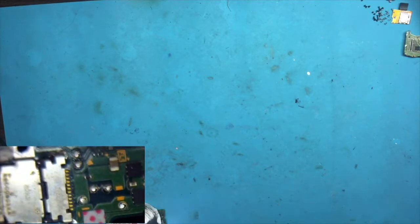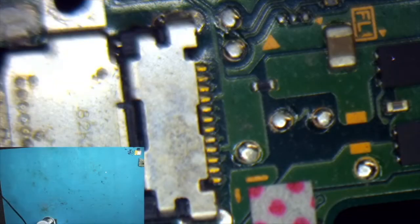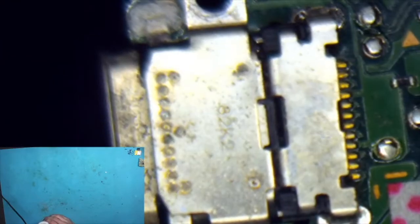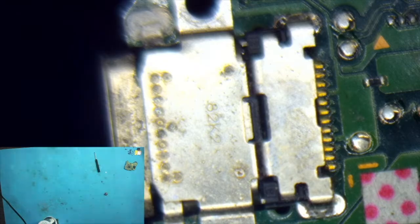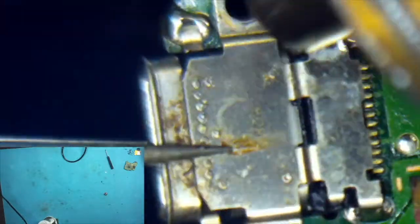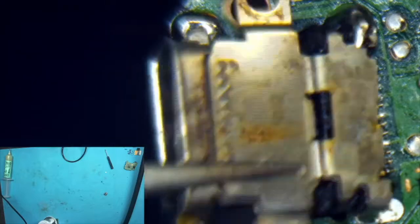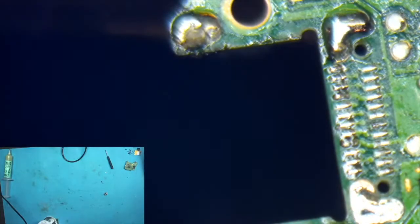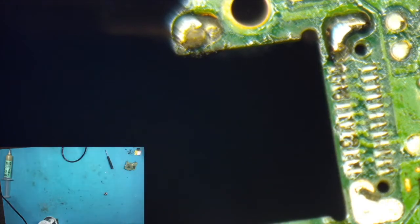So we're gonna go ahead and take it off. Take off the port. Lay down some flux first. Amtech. And then use my hot air. Well, actually, first I put down some low melt solder, so that way I didn't take as much heat to start to melt the solder.